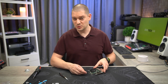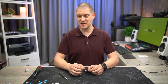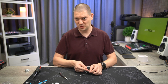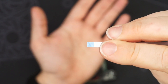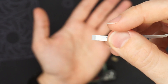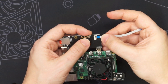There are a couple of reasons why the SD card relocation bracket might not work, but they basically all come down to the little ribbon cable. One, the ribbon cable might not have been fully inserted or may not have been lined up straight when it was clamped down. But the more embarrassing one that I totally got wrong is it was upside down. On the ribbon cable, the contacts are only on one side and the other side has a blue insulated backing. The blue backing needs to be facing up away from the PCB and the silver contacts need to be facing down towards the PCB. Otherwise your Raspberry Pi will not boot. So now we're going to reinsert this ribbon cable with the blue facing up, which is the way I was supposed to do it the first time.